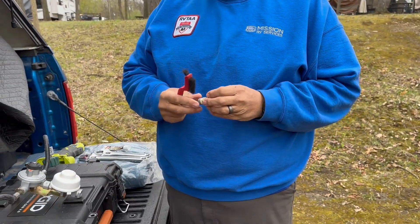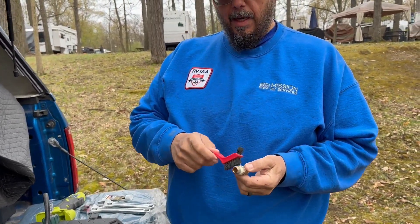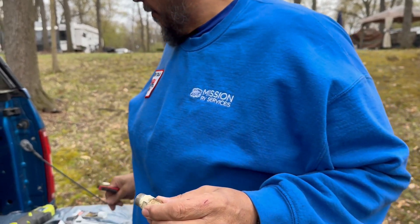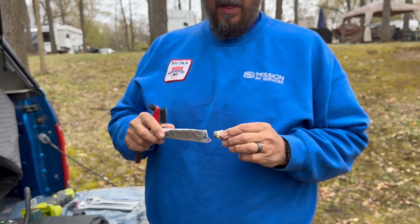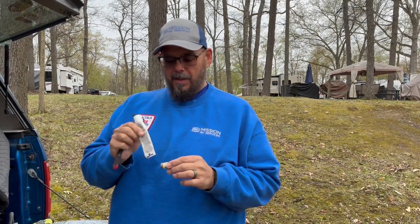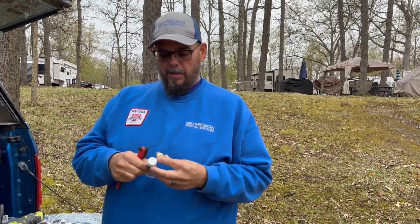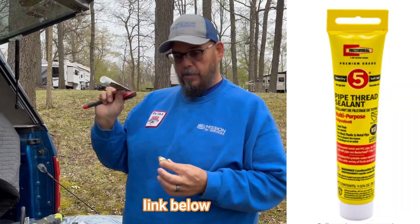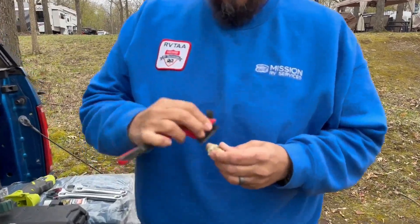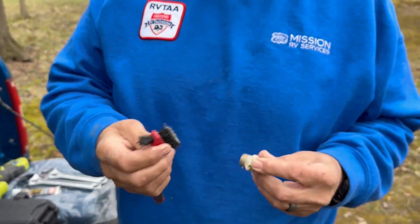We've taken the regulator off and one of the issues was it was leaking. What we found is that the sealant is not very good on this. We're going to take a stiff nylon bristle brush and clean all these threads, then use a thread sealant. Sometimes when you buy these they give you gas tape, but we prefer to use the sealant — it makes a better bond and that tape can fail at times in our experience. You can find this gas pipe thread sealant at Home Depot, Lowe's, Amazon, wherever.